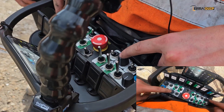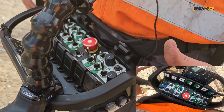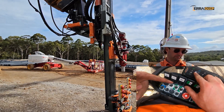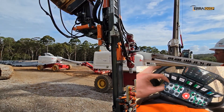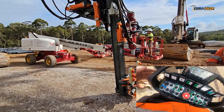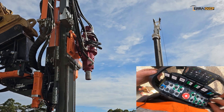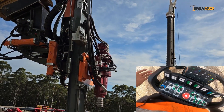There are three main functions - the three that we see from the pressure gauges: rotation, percussion, and feed. Then we have the automatic system. When I'm ready to drill, I can activate my rotation - this one comes on, this is the light you see. And from here I can adjust the speed, more and less. But when you're drilling it stays on, so when you move your hands it stays on. The same thing happens with the feed: I activate it, now it's zero, I increase, and as soon as they start to increase - that's your feed.